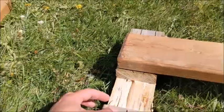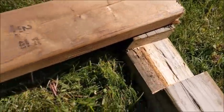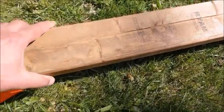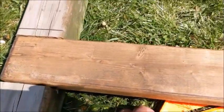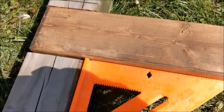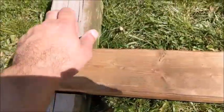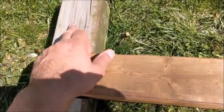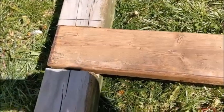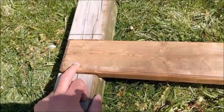So as you can see I notched them out. I used a chisel after I sawed it down. What I'm going to do is put a two by four in here, then square it using my square, and then screw one board in there, one screw in there, and then square that side and square that. Then I'll put the one by six above it here to this line. Screw that and then this half is done. I'm going to square this and screw it in and then we'll come back with the next step.